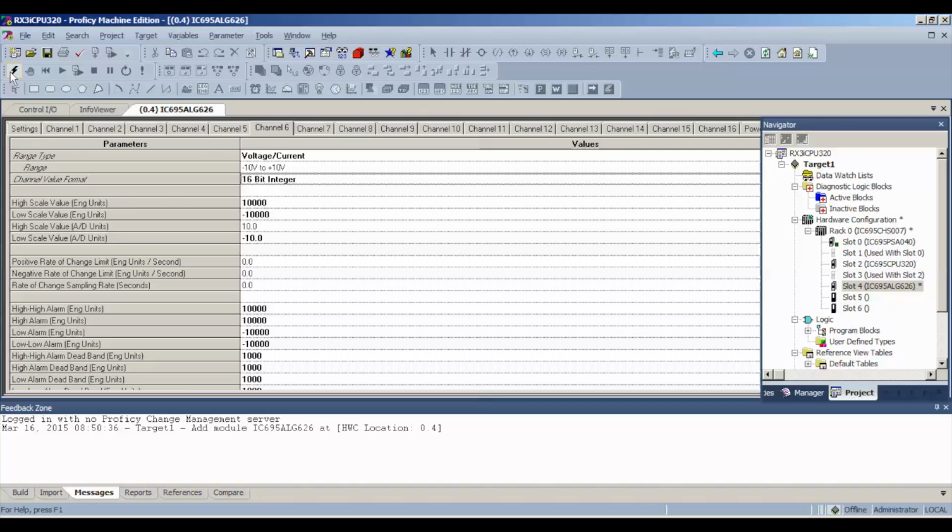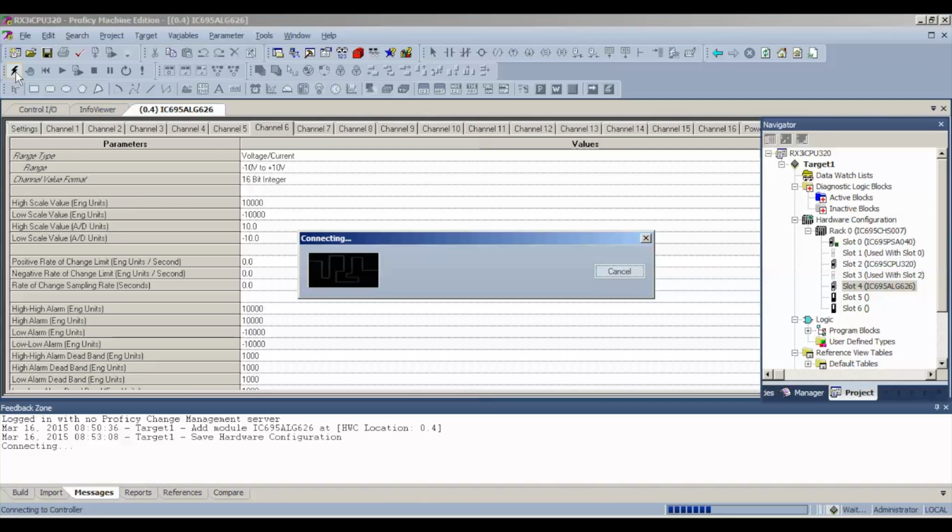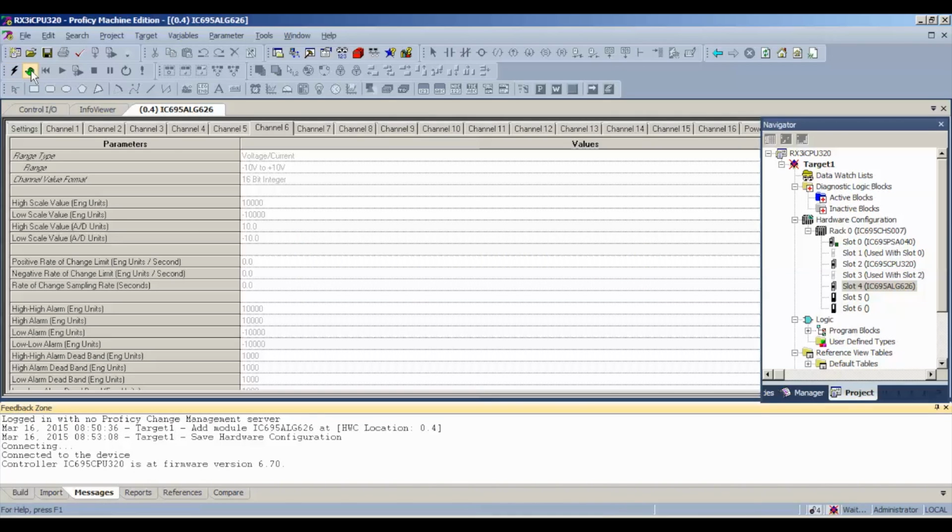Okay. Next thing I want to do is connect up to the processor by hitting the online offline lightning bolt icon here. And once we are fully connected, we're going to hit the green handprint to toggle us online mode. All right. Now follow me down here, follow my arrow. This status bar at the bottom is important. It's telling us that we're in programmer mode currently because we're toggled online.